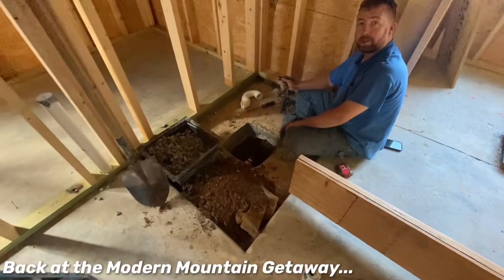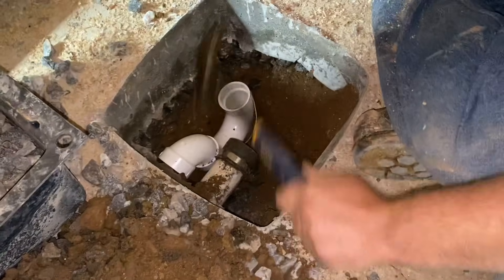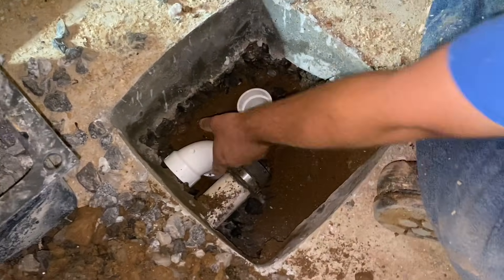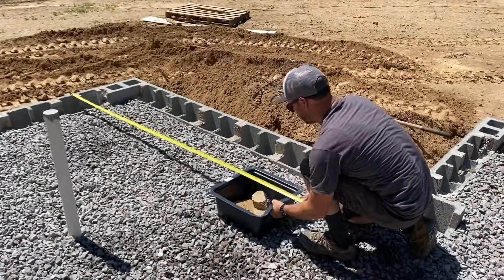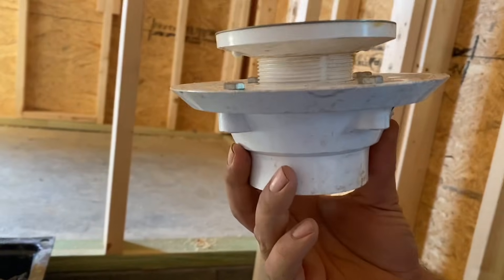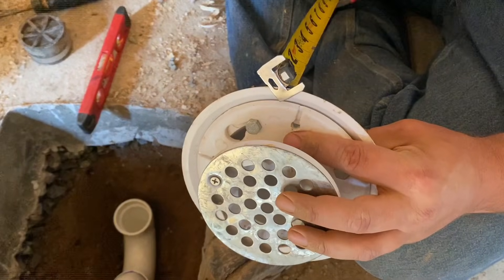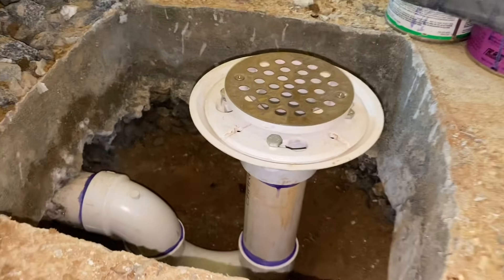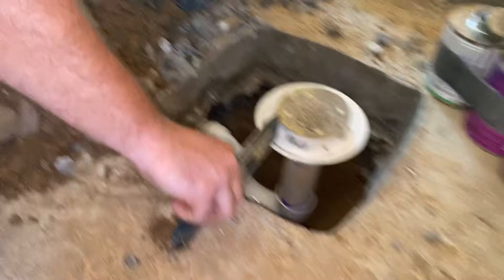So there's a lot going on in this episode and I'm going to try to squeeze in as much as I can. Let's start with the plumbing. Our plumber started by finishing the drain side of this plumbing system, and this is the drain box underneath the shower where the p-trap will go. You can remember in a previous episode we set this box in before we poured the slab so that it would make a void in the concrete. This shower drain is especially made for tile showers — it's adjustable up and down so that you can set the height to match your shower pan plus the thickness of your tile. Here's a look at the drain and the p-trap all hooked up. This hole will be filled with concrete or compacted gravel before we pour a shower pan that slopes towards this drain later.